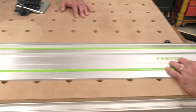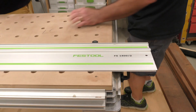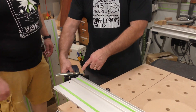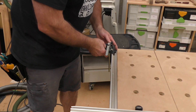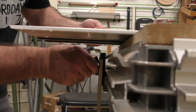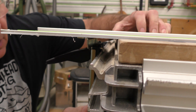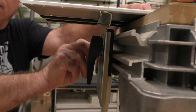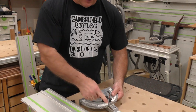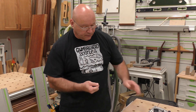Put the dog up against there — I will never rely on this to be square. Tighten the screw underneath and lock it down. Put this little pin in and make sure it seats in there, then lock it down. Slide it in with no tension and up against the stop. I'm going to lock this, but I will not rely on that being square — I'm going to square it properly. This gives us that rough adjustment so when I set that down I'll have the cross cut capacity.